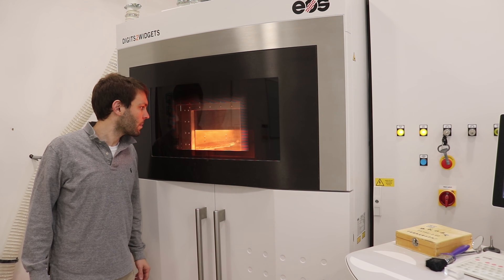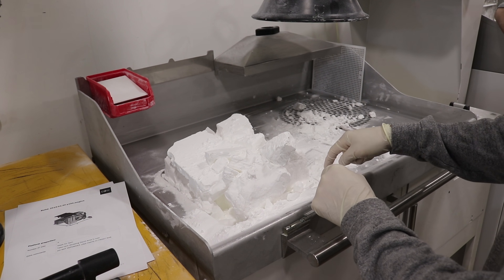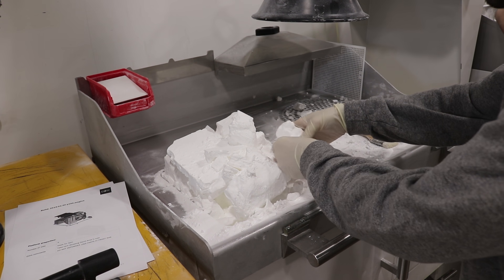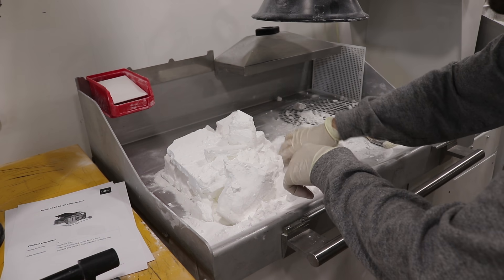The Italian company Lunati SPA made these with an entirely different 3D printing method called SLS, or selective laser sintering. These parts are built up using powder and a laser basically welding only certain areas of the build chamber. The powder is then removed and you have your detailed part. These printers cost in the hundreds of thousands and are the size of a massive freezer, so a team of people running a bureau is the best business model.